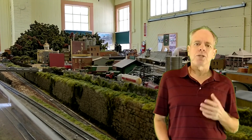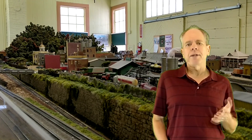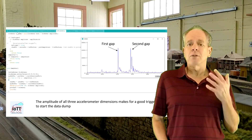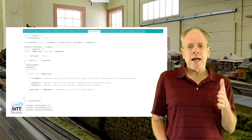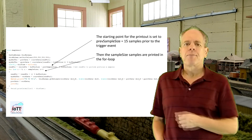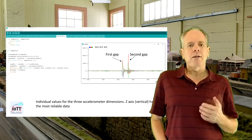So I started to dig deeper. I modified my sketch so that the displayed data is no longer continuous but is triggered by the axle going over the groove. For this I calculated the amplitude of the accelerometer values and it turned out that a value of 30,000 was a pretty reliable trigger. Whenever the trigger occurs, I call a dump-data function to plot the values of the 25 last measures prior to the event and the next 300 values, so I can analyze the curves leading up to the trigger event and shortly thereafter — first for the accelerometer data, then for the gyroscope data as well.